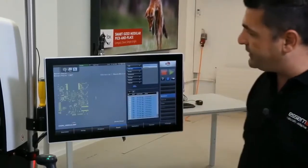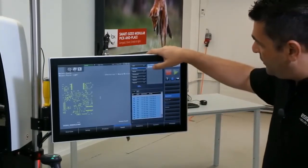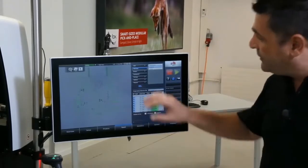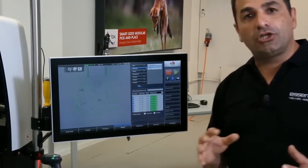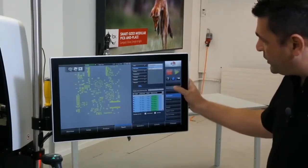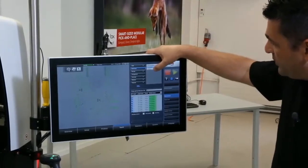So let's assume we will take, because this is our region of interest, and we enable them. Now, as soon as I enable them, it means that later on we just need to group them. As you can see here, we entered another menu where we are going to group different pad sizes. So for the machine, it will be easier to calculate what kind of dot it needs to put inside. Once I tell it select all, and I say group shapes, big shapes go together and small shapes go together. Then it will be easier for us later on for the filling.